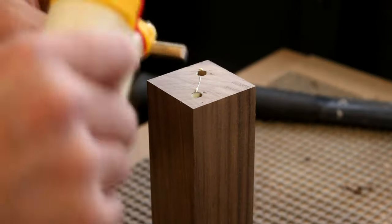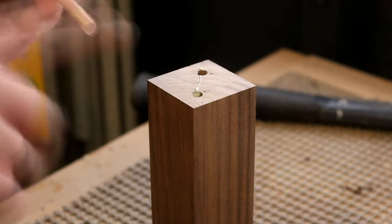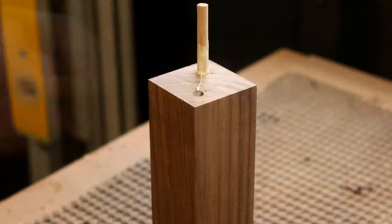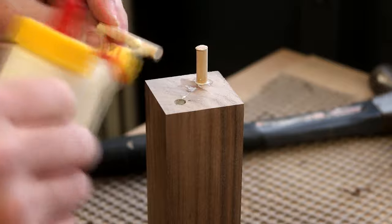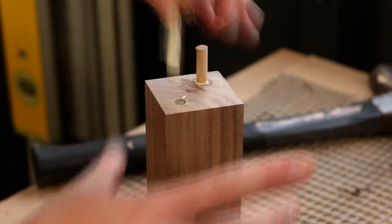These only really need one larger dowel — a 10mm or 12mm would do the job — but I only had 6mm so I went with two dowels instead. If you're using one dowel, it can be aligned by simply marking centres on the back panel and on the end of the walnut piece.